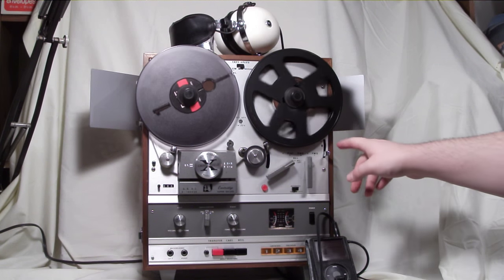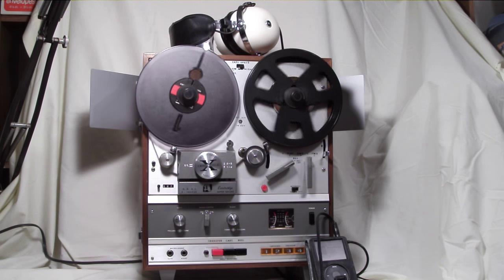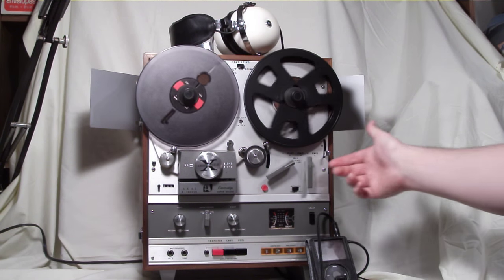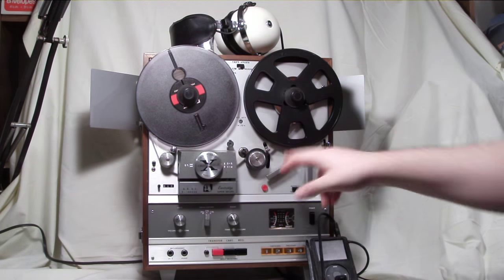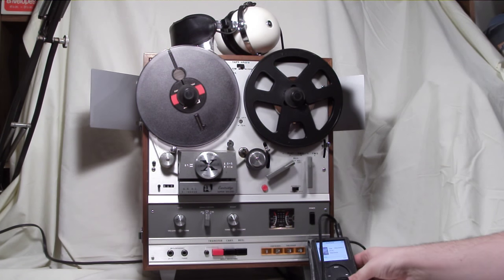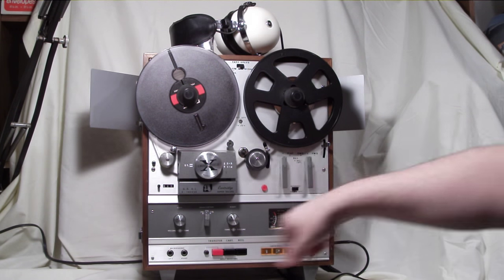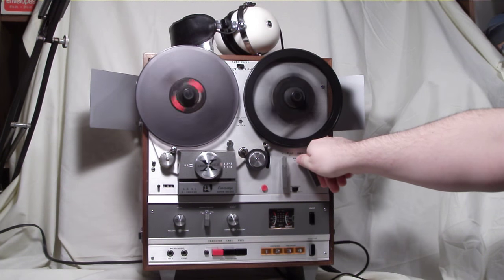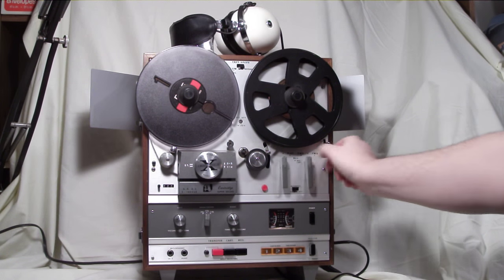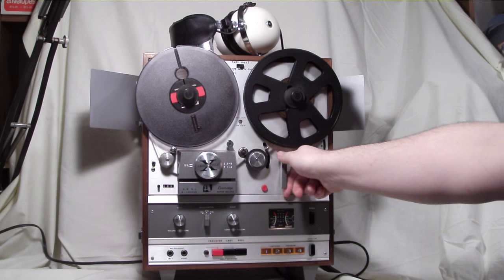The reason I had the stop lever on is because it's a mechanical lever — it's not electric. So when I remove or apply that lever, you won't get a pop or click; it just mechanically stops the tape without any sound being recorded. We'll pause the audio source, stop the tape, and rewind using the tape counter back to zero. And we will play back our recording.